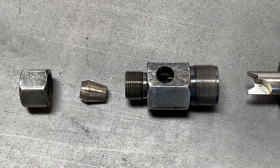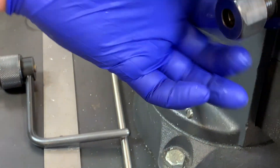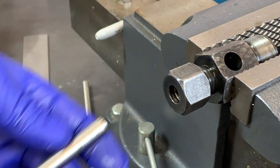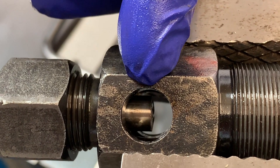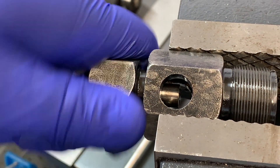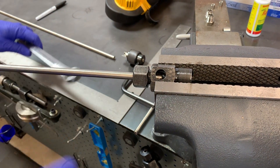Let's jump into the coning tool, starting from the right side. Here you see the actual cutting tool; in the center is the main body, then the collet and then the collet nut. We are going to put the coning tool inside of a vise on the left-hand side. Note that the coning cutting tool portion is not threaded in at this stage. Go ahead and put the piece of tubing through the collet and have it in the middle of the sight hole as seen here. Hand tighten the thread, then grab a one inch wrench and tighten down the tubing using the collet nut. It is important not to over tighten, as it will make it easier to remove the tube when you are done coning.